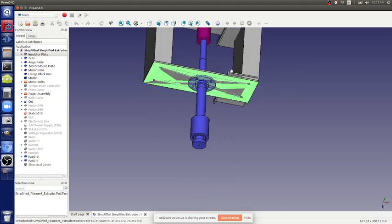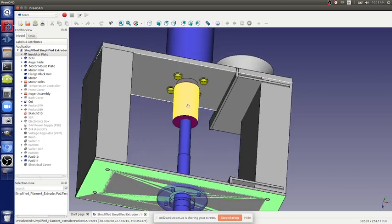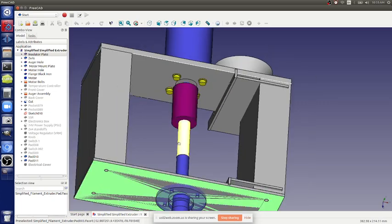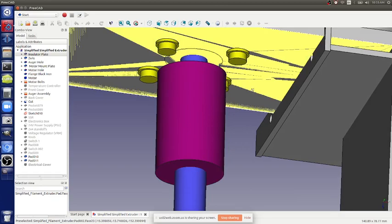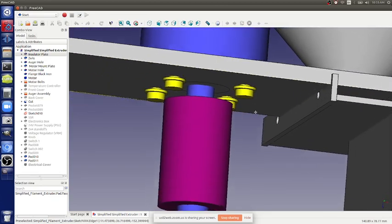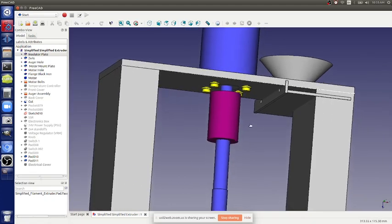But what's in there? You've got to couple the motor to the plate. You've got to have a coupler, and you've got to have the auger bit. The auger bit has a hex shape shank, so you can couple it geometrically. It's not shown here, because that's a round thing. The trickiest thing here is how do you couple the motor to the auger? Because that's the boundary, that's the interface.